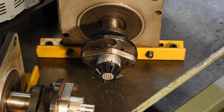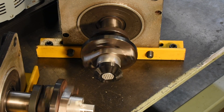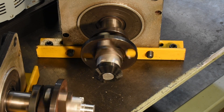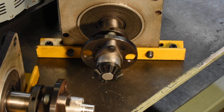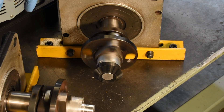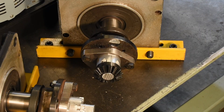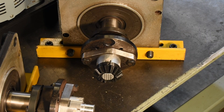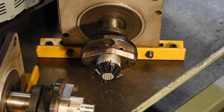So I'll run that now. It goes full speed in one direction, then steps down a few times to go full speed the other direction. At each step it measures the exact amount of torque required to maintain that speed. It orients at the end to begin testing. Now that it's calibrated, it has saved all that information and can apply it when it wants to make the output torque a certain value.